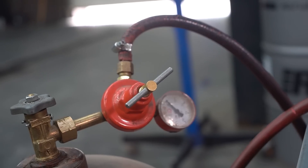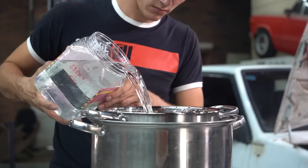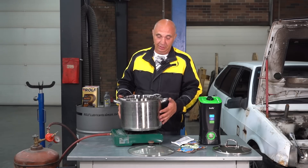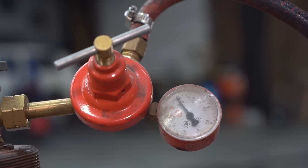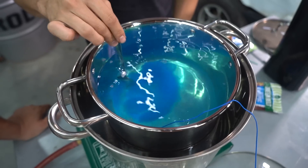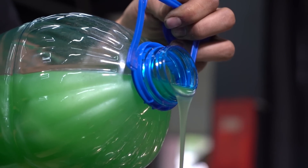Before we get started we need to make a highly concentrated copper sulfate solution. We're keeping things simple and old-fashioned. We have a big pot, pour some water into it, then place a second pot also containing water - this is what you'd call a water bath. We'll slowly warm the water up, and in this hot water we will slowly be dissolving the copper sulfate. Once we achieve a concentration where the copper sulfate is no longer dissolving in the warm water, that'll mean the solution is ready.